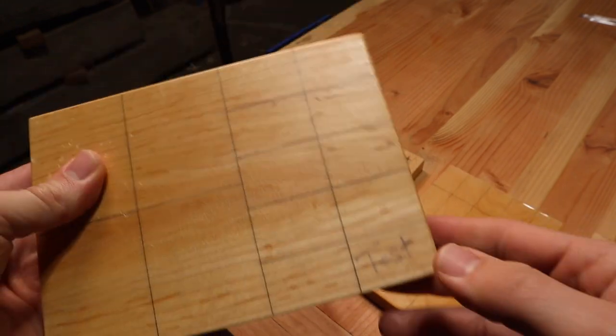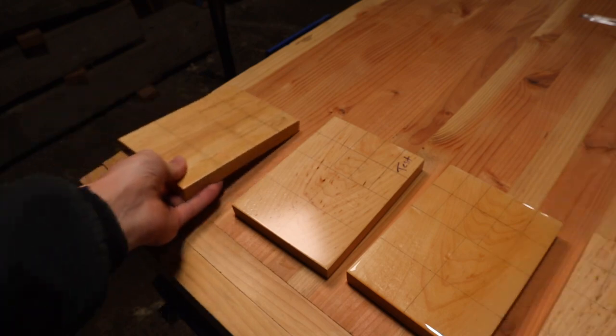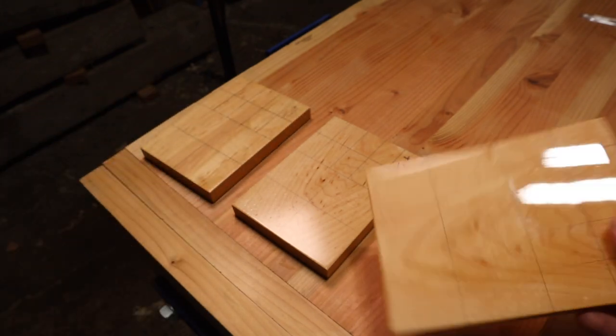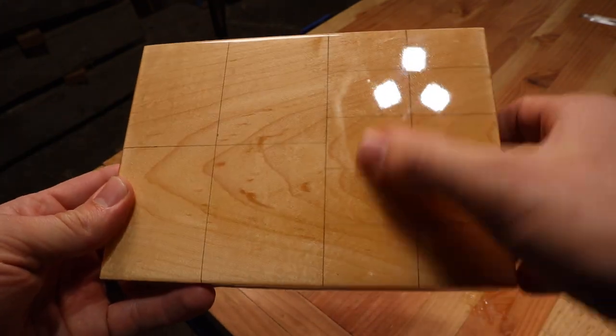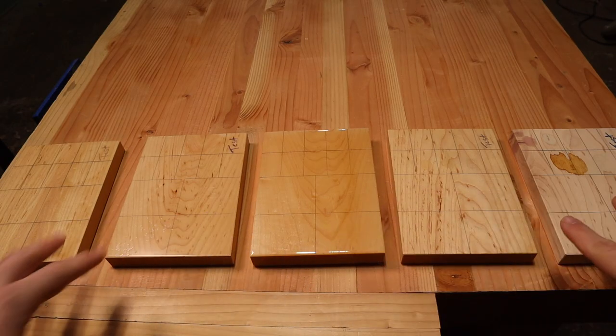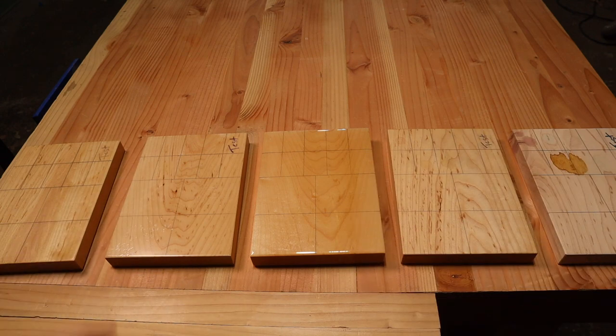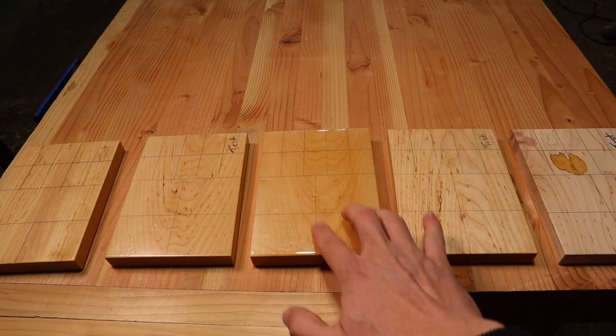If you take the Sharpie test into consideration for that kind of staining, the epoxy was by far the clear winner. Everything came off of it. And there was nothing that stained it over here at all. Okay, so again, out of all of the finishes that we tried, whether it was nothing, Rubio Monocoat, epoxy, lacquer, or polyurethane, in my mind, the clear winner is the epoxy.